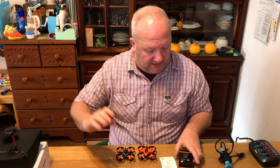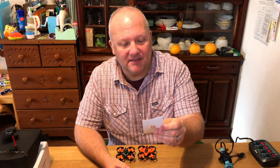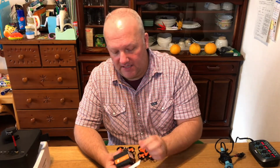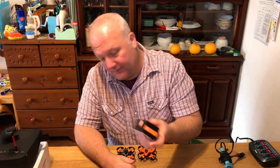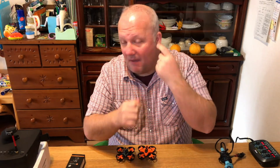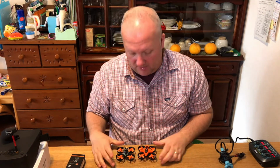The other thing you're going to need obviously is an FPV camera. It's the model FX797T and it comes in a little box like this, and it's really easy. What I did is I actually snipped off the main lead connector, so I was left with just a red and a black wire, and then from there I could easily solder that onto the quad.